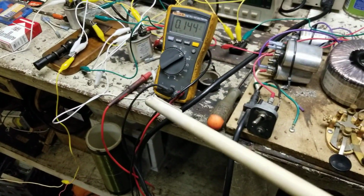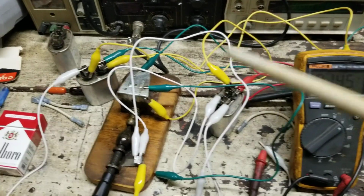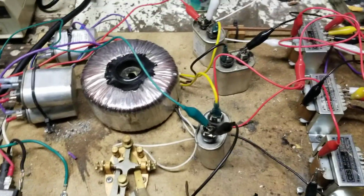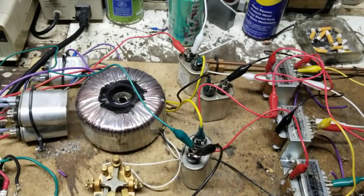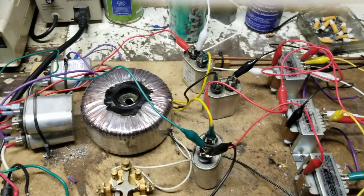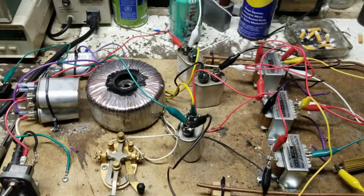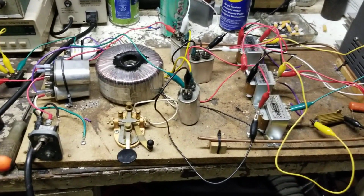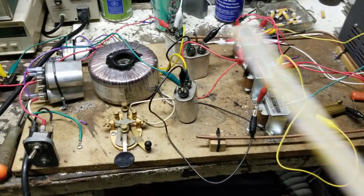So perhaps a properly timed connection to that capacitor would allow it to be used at peak cycle times per se and not disturb the reaction. If it arcs when it's at full voltage, it's much easier to sustain the reaction because there's so much more energy being used in there that there's enough ringing left going on that the reaction keeps starting. So it seems like it runs in a constant state of trying to, like a misfiring engine almost. It would trigger, and then you would have a dampened kind of a bounce back and forth.